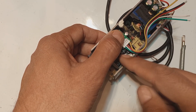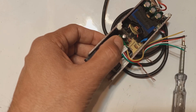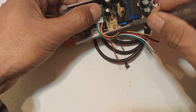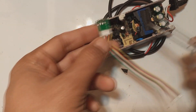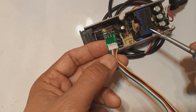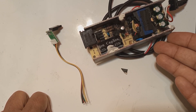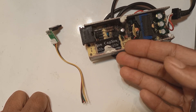This additional module will take the place of the switching IC as well as the MOSFET, and we will make the interconnections to the power supply. This module is flexible and can be fixed in almost all power supplies using the same concept. Different modules are available — some have two transistors, some have a single transistor. This one is a single-transistor flyback type power supply, which is why we are using this module. This is the smallest module available in the market.